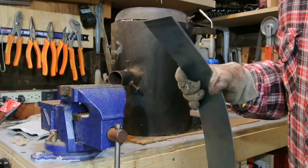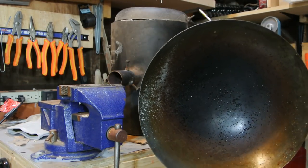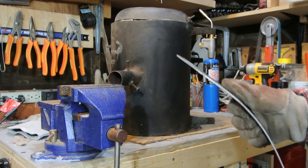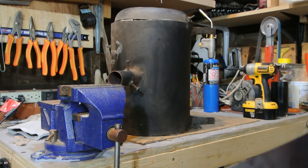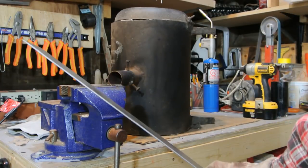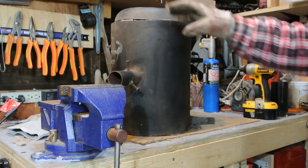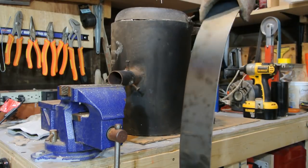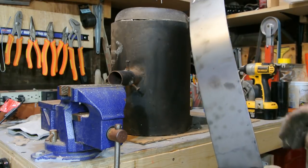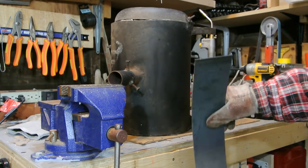Now I need to bend a ring for the wok. The wok I have is 14 inches in diameter, so I'm going to size the ring for the base where the wok will sit to approximately a foot across. I have a piece of 14-gauge sheet steel and I'm going to bend it around this steel pipe that's approximately a foot. I don't have a roller — ideally I would roll this — but I could also use an old propane tank. I already have this plate so I'll give it a try.